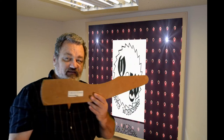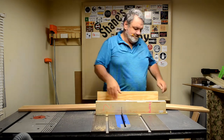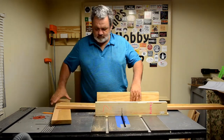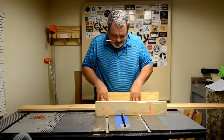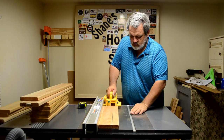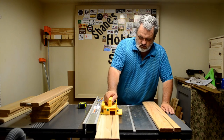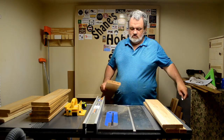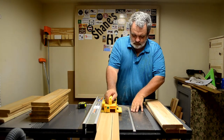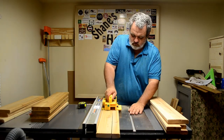Now what we're gonna do is take these boards, transfer these patterns on over to our cedar, and start cutting them out. First off, I'm gonna cut the boards down to a rough length — not a final length; about an inch bigger than what the pattern boards show — and then rip them down to the final width. Some boards won't need a pattern, like the seat slats, since they're just regular rectangles. I'm paying attention to the edges to see what side is good and what side is bad, trying to cut off the bad parts. It's actually a pretty good selection.